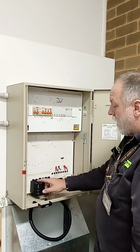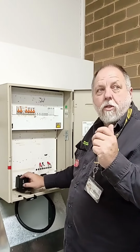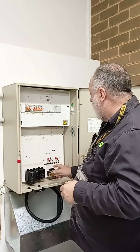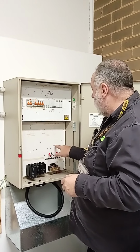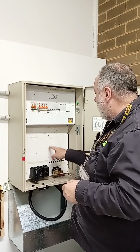All right. If you've got an overhead attachment, these are used more for isolation for the meter readers to come along and just isolate. They don't have to pull a pole out from the point of attachment. All right, so we need to have a look behind here. We've got a cable tie notice behind here. This part at the top here is for the single phase meter.